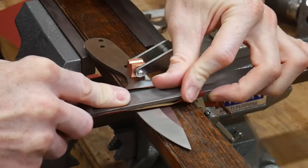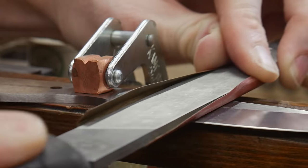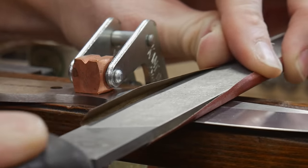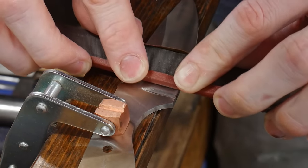These initial steps really aren't necessary, but I decided it would be worth showing how to clean up the blade a little. I used a file wrapped with 320 grit sandpaper on the plunges in an attempt to make them more symmetrical. While I didn't quite achieve perfect symmetry, I was able to move them closer to matching with this method before my patience ran out.